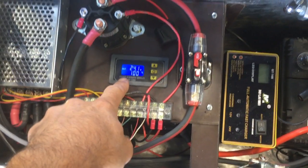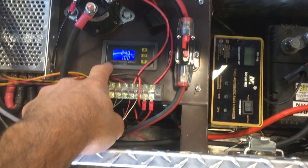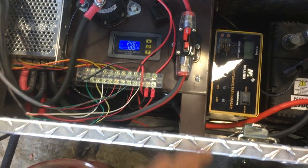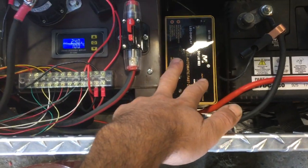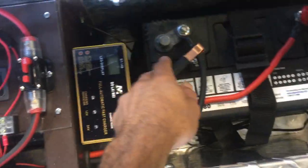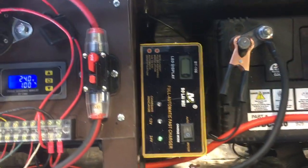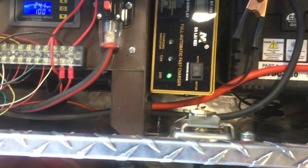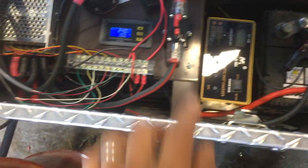This is a battery over-discharge protection device, so it prevents the whole thing from running if the battery voltage drops below a certain level. This is a charger that's currently disconnected, because it always keeps a tiny drain — some little caps or something are always charging.